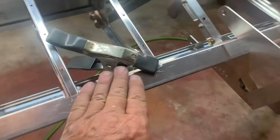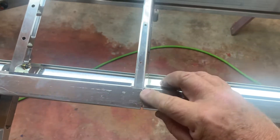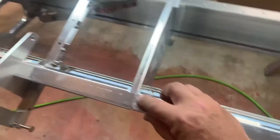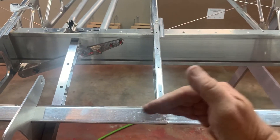There's going to be another Cherry Max that's going to go in here, but not now. Right now, we're letting that stay because this is going to be adjusted a little bit. The pre-drilled holes — you can see where this goes up through here. Just kind of get it into position. Now go down to this end. The inboard part is pre-drilled, so this part is going to go inside here, and on the bottom, the inboard one is the one that's pre-drilled. So the outboard one is going on top, on the top only, and then on the bottom side the inboard is going inside underneath the outboard. Just look at the pre-drilled holes.